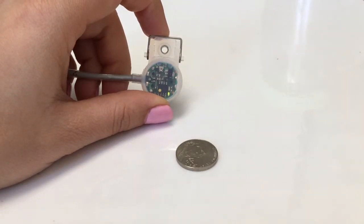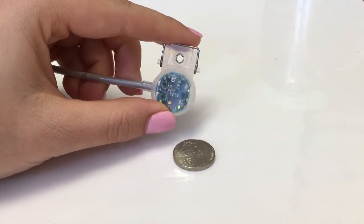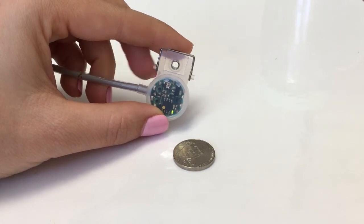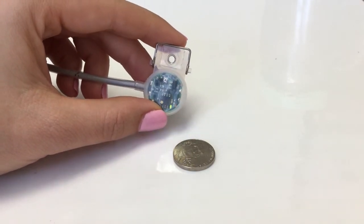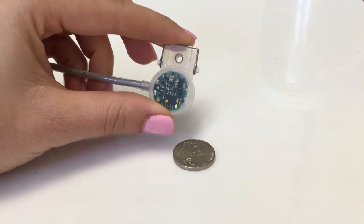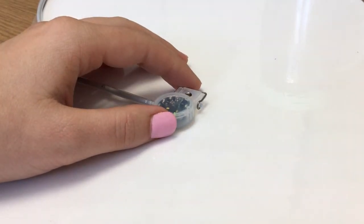As you can see, the sensing head of the HPQ-D is relatively small — roughly the size of this nickel here, just for size comparison. You can actually see that this cable is overmolded into the housing of the unit. The housing and this overmold is PFA material, so it's going to help protect the sensor and the cable from some of the nastier chemicals and other nasty stuff this might come in contact with.